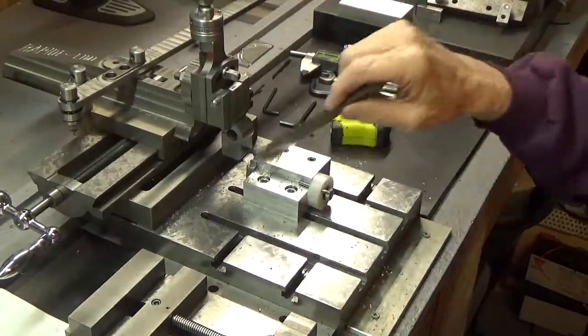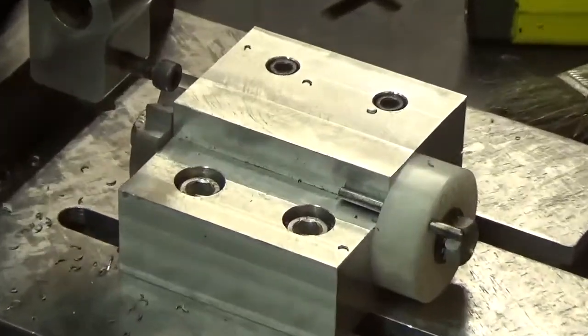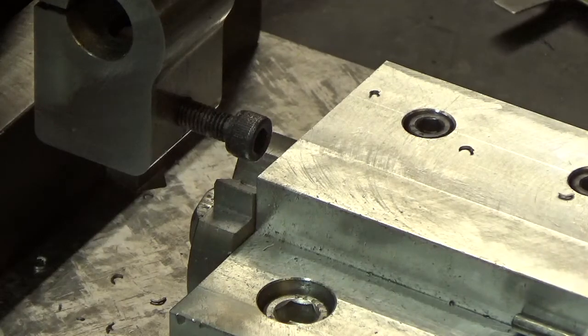I think I'm about down to the bottom of the cut — I've got a ways to go but I'm about three-quarters done. You can see what's going on; not a lot of light down there. We'll get to the bottom of that cut. I can look at my vertical feed and see how far to go. I have a stop set up on the other side of the carriage so I know how far to go in that direction. It's actually working out perfectly — I cut the first tooth with no problem at all. I'm going down exactly a quarter of an inch, two hundred and fifty thousandths.